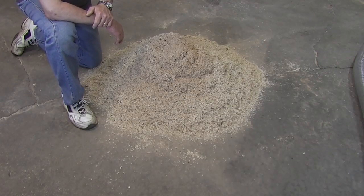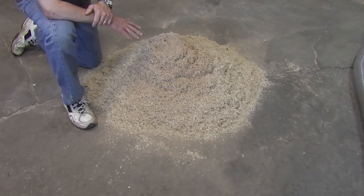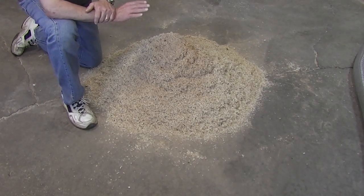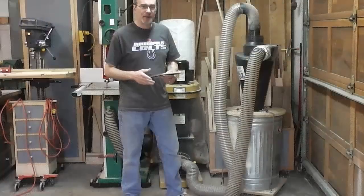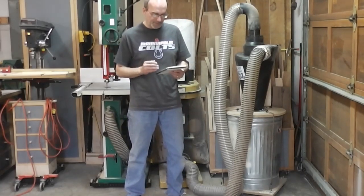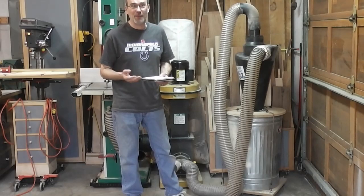That's what 15 pounds of sawdust looks like. I'm actually going to run this through the dust collector three times with the dust deputy, so once I do this three times I'll measure again and see what the differential is when the felt bag gets dirty and restricts the airflow. After running 45 pounds of sawdust through it and dirtying up the bag, the velocity on the end of the hose went down to 2,450 feet per minute — a decrease of 300 feet per minute — which went from 240 to 214 CFM, a drop of about 11%.